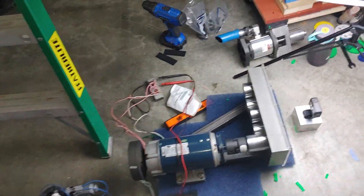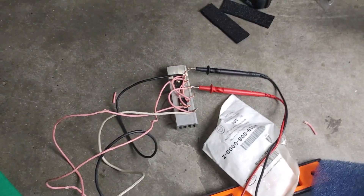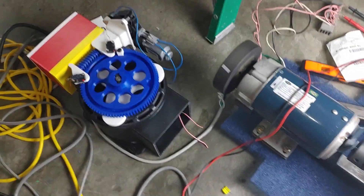That last video took a bit too much power and I blew the bridge rectifier, so I've doubled two up. I keep meaning to pick a bigger one up but I keep forgetting. It's made me realize that I shouldn't be on the limit of this whole setup because I really don't want to damage the variac.